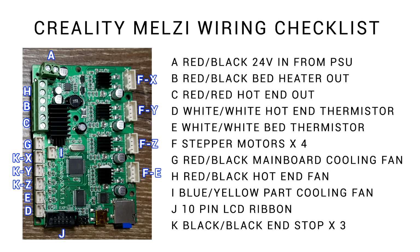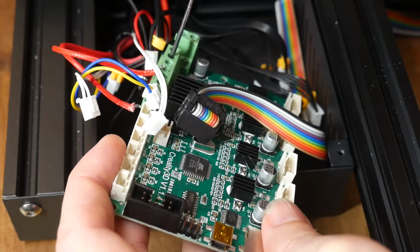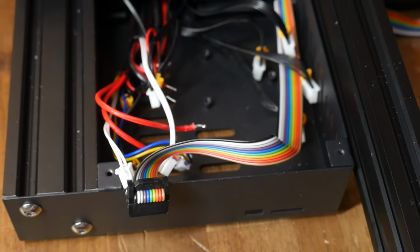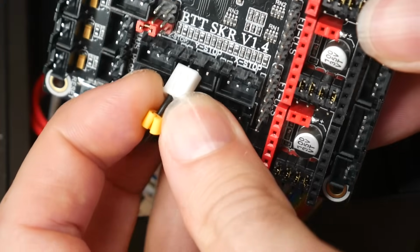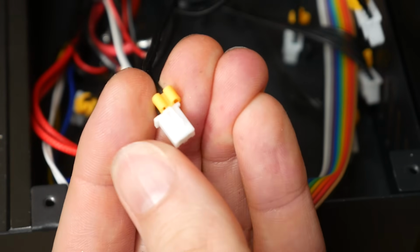For example, on an Ender 3, I would recommend printing out this diagram I have in the description, removing the hot glue holding on the plugs with some pliers, and then unplugging or unscrewing the wiring one by one until the board is free. You should then print this diagram where all of the labels correspond and plug everything back in as labeled. All connections go completely back in without change, apart from the three end stop plugs, which no longer fit. This is an easy fix, however.